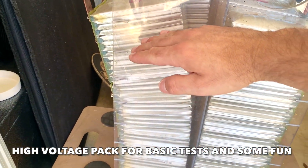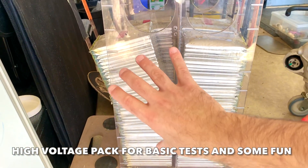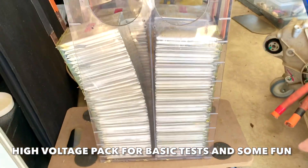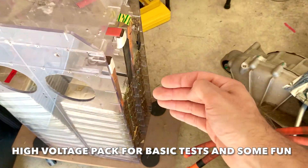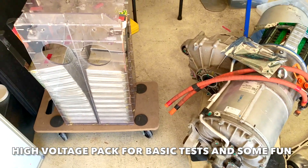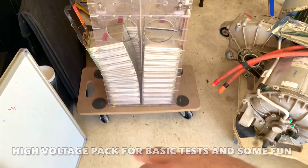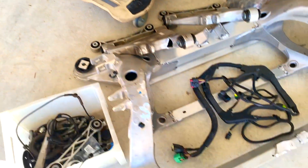This module — all the cells from here to here — they're all at zero volts. That's why this pack is puffing like this. The top cells are okay and the bottom cells are okay, but in this section they're all dead. This is 400 volts, so I would be using two modules in series to get the voltage I want, and have a spare module just sitting there just in case. The other cells are just gonna be pulled apart and go into a recycling bin.